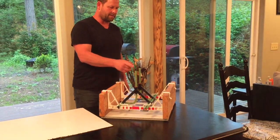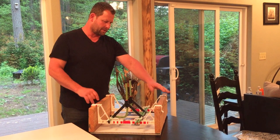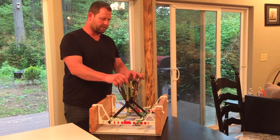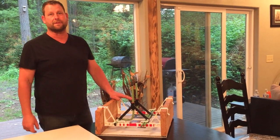Ready to pour. You can hit it with a concrete pump — it does not matter. There is nothing in your way. There are no cleats across, no braces, no nailing on 2x4s for your verticals. There is no tie wire involved here. That is a complete system.